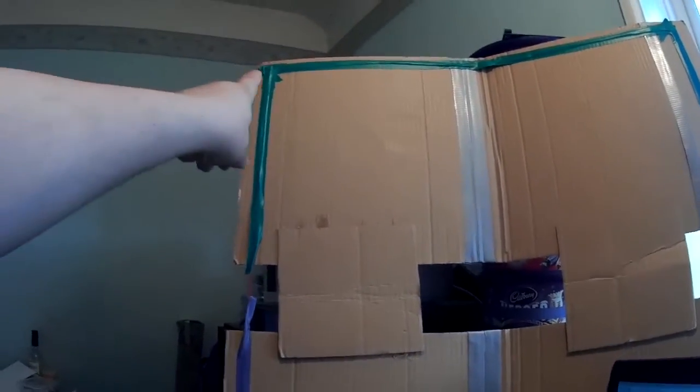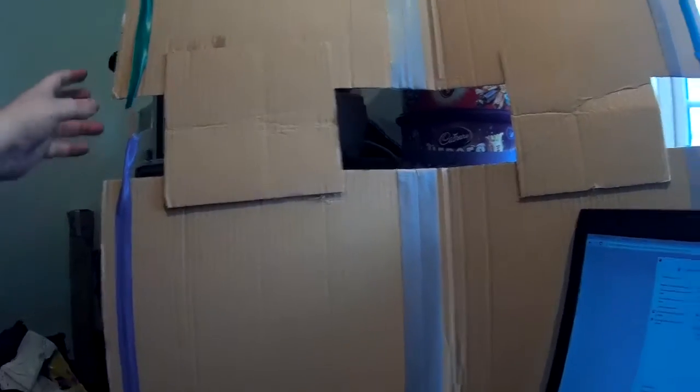Anyway, I'm waffling again. So five turns of wire, each side from like there up to there is 26 inches, and again 26 inches corner to corner all the way around. That's just trying to be in keeping with what was described in that table that I showed you from the stealth antennas sample of the book.